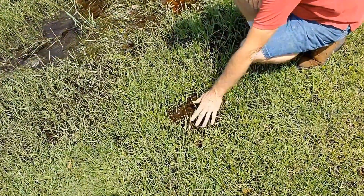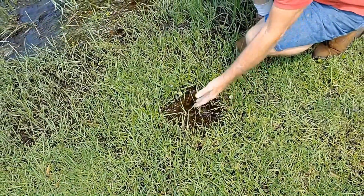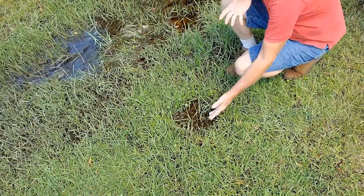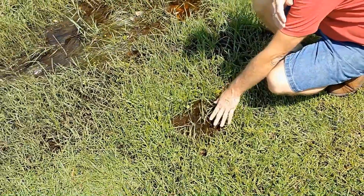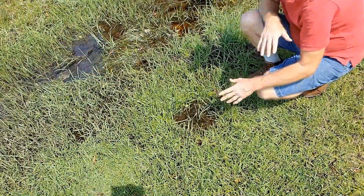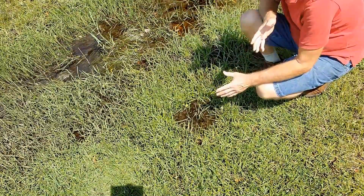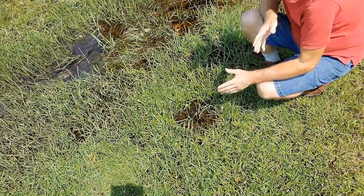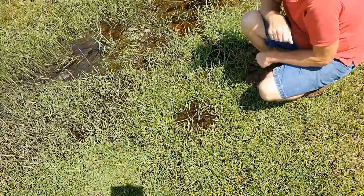You can see this little wet spot right here — I know that's where the line comes out, but when I push the hose, of course it's not coming through there. It's just overgrown. I turned the water on and you can see it coming out here, but we still don't see where that pipe is. So let me show you a really simple thing you can pick up at any hardware store — I think they're like $15. They call it a drain bladder, but it works really good. I call it a flush bag. Let's go ahead and set that up and see if it blows this open.